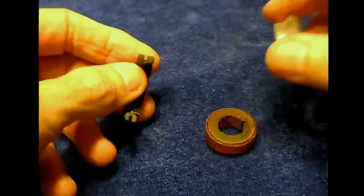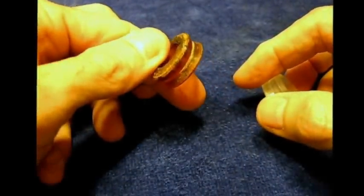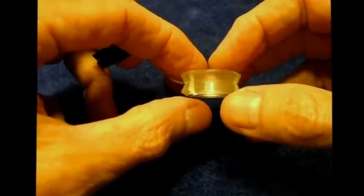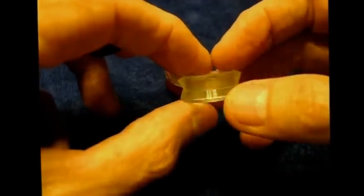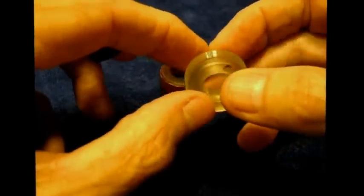I'll show you a sample wheel. There's no way I could get amber. This is amberoid, a composition. They don't make this anymore. So I had to use new materials. I got plexiglass round stock rod, and just on a chance, because I remember what it was like to wash airplane windows, plexiglass, and polish them with a rag, they would squeak as you got the plexiglass clean. So I figured it's got a good coefficient of friction.